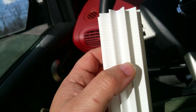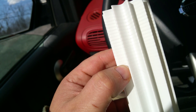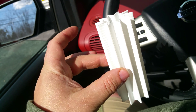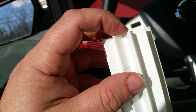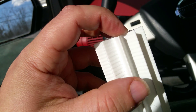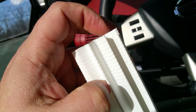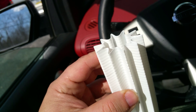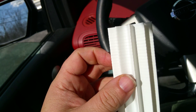What is causing that? My suspicion is that because this is so tall and so thin, the actual nozzle head is pushing the object back and forth as it's printing. That little force as the nozzle head pushes through the previous layer of plastic is actually rocking it back and forth slightly, and that's what's causing the imperfections. I'm not entirely sure though.